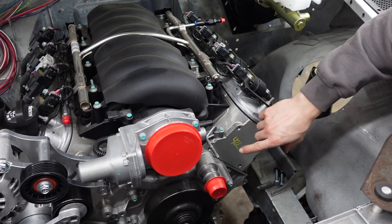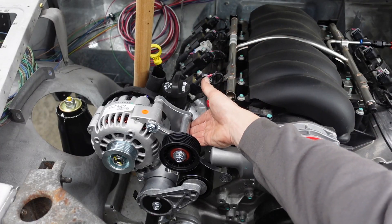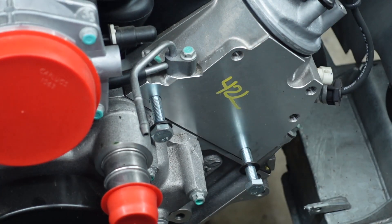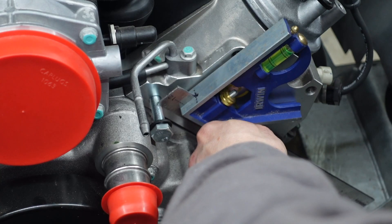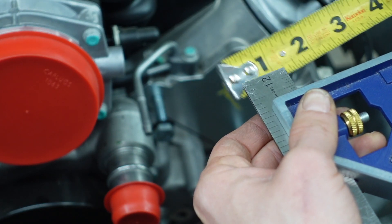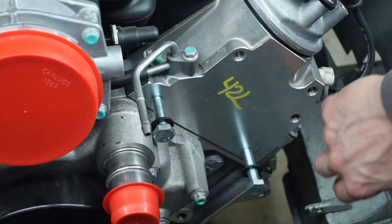I'm by no means the end-all be-all on how to do this, but I'm going to lay out these holes first — I'm going to have a plate that goes up against the head with some spacers and another plate. We figure out the bottom holes: those guys are four and three-quarter inches apart. I threaded two bolts in, centered the pump up on those bolts, and found that hole sits three-quarters of an inch in from the edge. Going up from there: two and one-eighth inch on the tape, plus the one inch of the bar gives us three and one-eighth up from the hole.